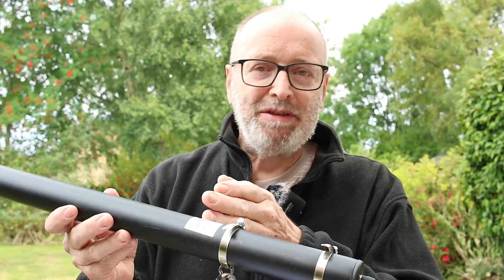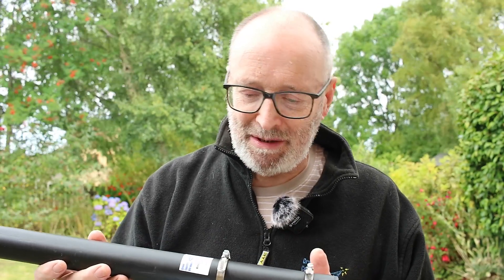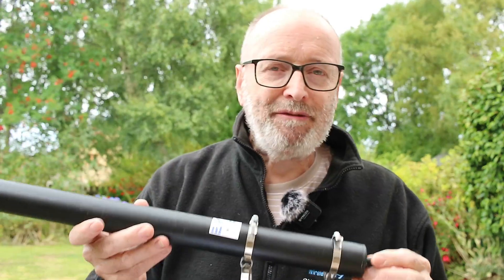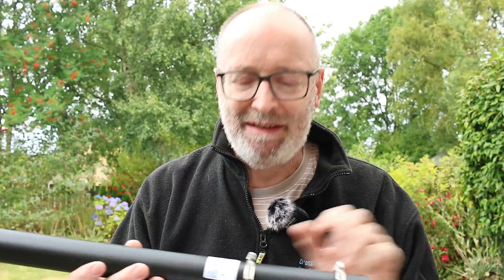To make that work, the section below the label is stacked with ferrite as common mode chokes and gives typically 40 dB of isolation between the feeder and the actual antenna element and amplifier itself. There's quite a high performance amplifier inside here which is perfectly matched to the antenna element.